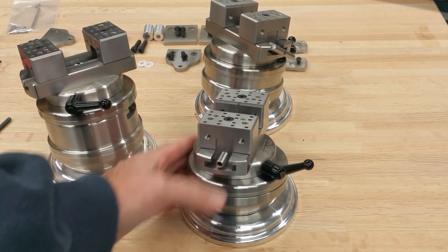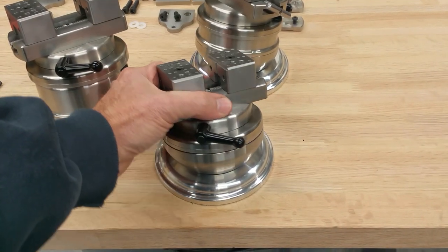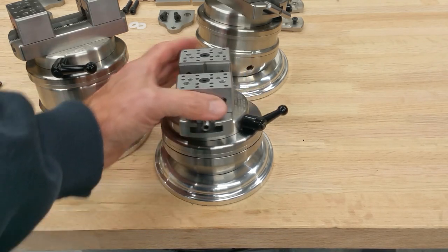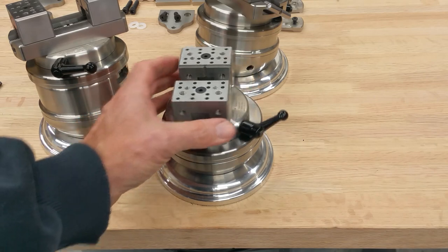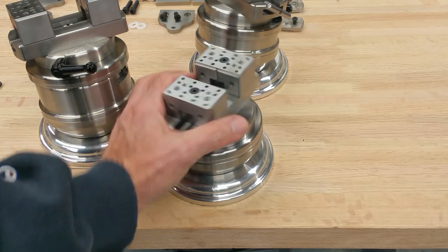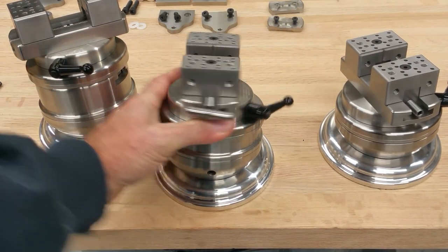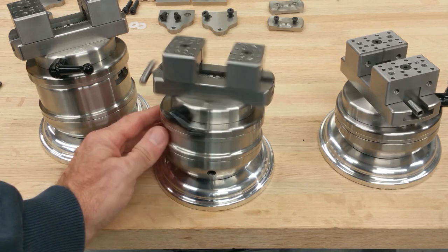This one's cut down even further lower yet. There are pros and cons to taking the vises too low or too high. If you get them too low, there's no concentric place to turn the vise. With the low version you're turning the spinning device up top, which is usually fine for jewelers, but if you're engraving you'll have to stop and start to get another grip because it's an obstacle course up on top. With a higher version you have a nicer concentric place to spin it.